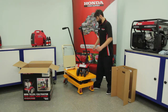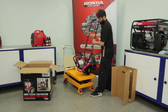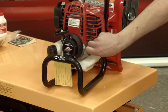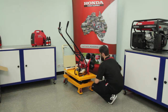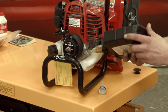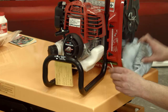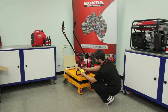Place the tiller on a level surface in the maintenance position with the engine upright. Remove the dipstick and add enough Honda 10W30 premium engine oil to bring the oil level to the top of the thread. Wipe off any excess or spilled oil and replace the dipstick. Remove the yellow no oil tag.